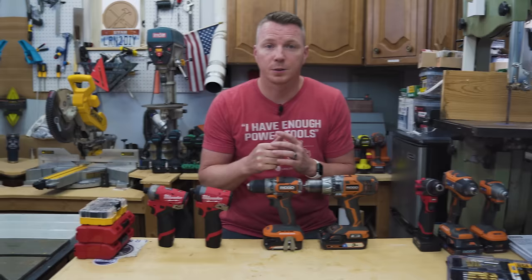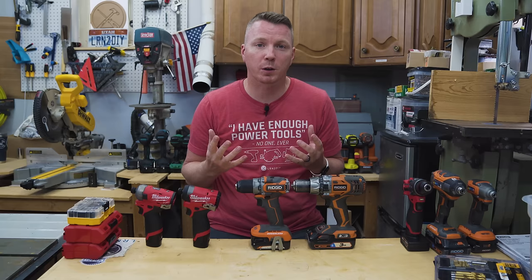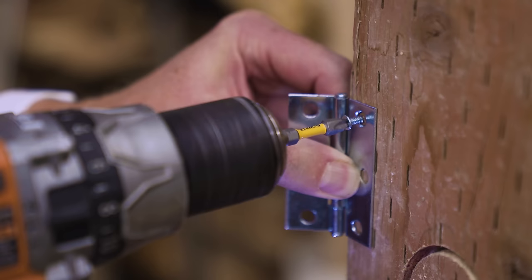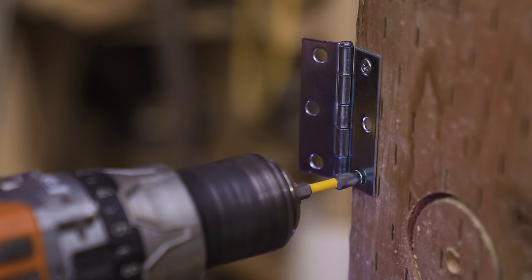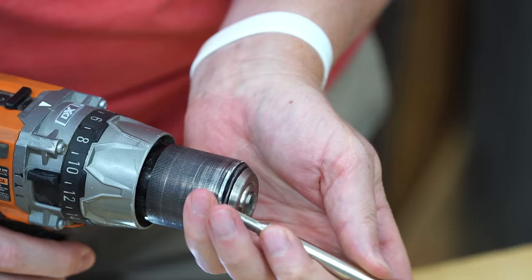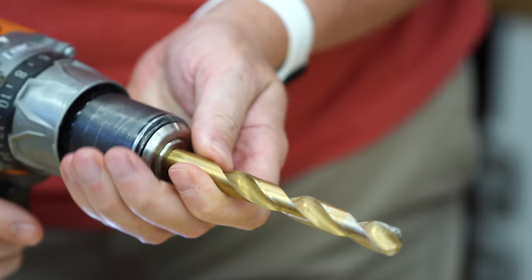So when do you use your drill instead of an impact driver? There are several scenarios. One is fine woodworking where you need precision holes, clean edges, consistent drill speed, and don't want that impact noise — grab your drill. Another is when you need to use the clutch to limit torque on a fastener, like driving a small screw into soft wood where you don't want to overdo it — torque is much easier to control with a drill. The other occasion is if you've got a bit that doesn't have a quarter-inch hex shank and you need to use it. Drills are still very useful.